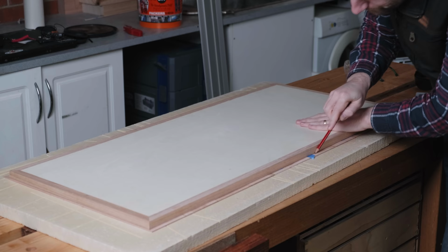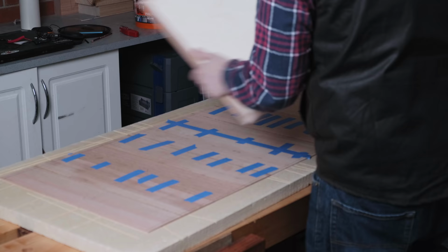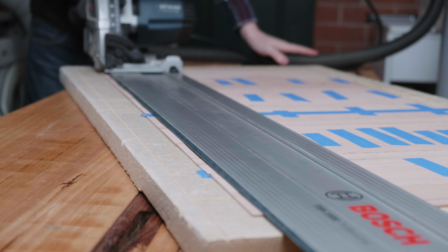Trimming the veneer sheet to be closer to the size of the panel is a little tricky to do with a table saw, so a track saw or regular circular saw on top does the trick. The panel itself is the reference, leaving a little bit extra for safety during glue up.